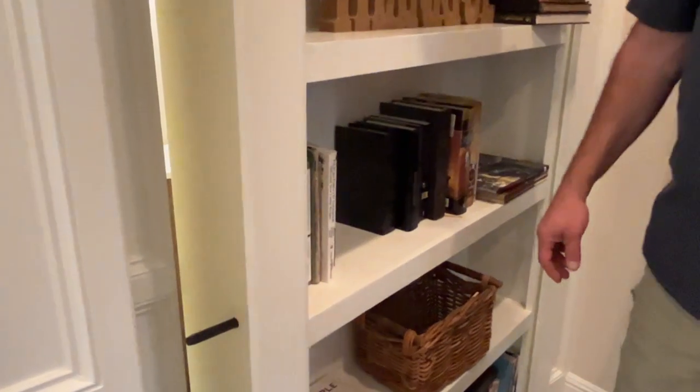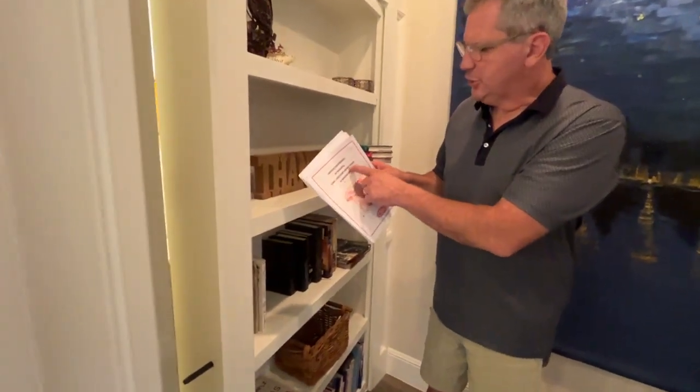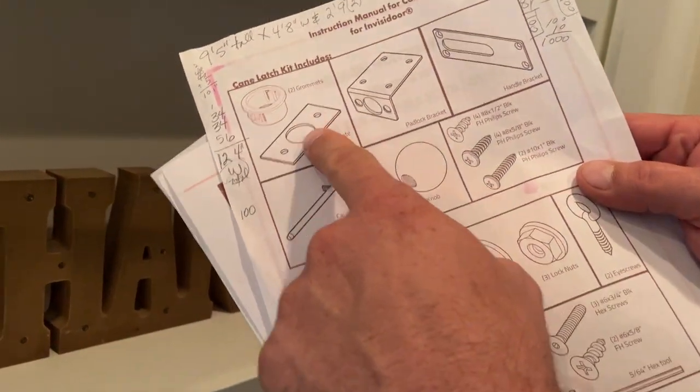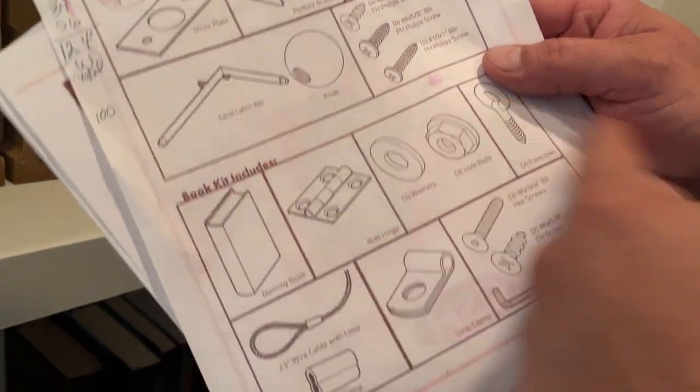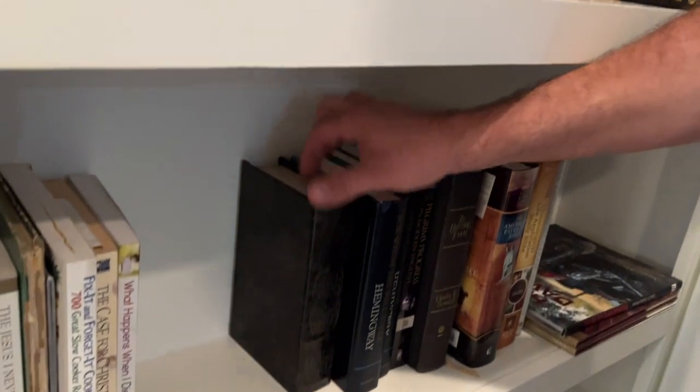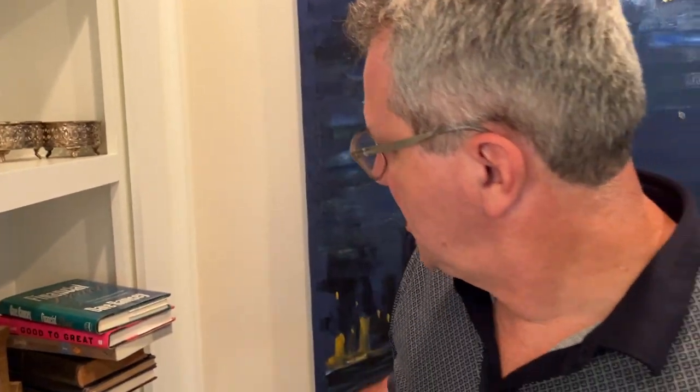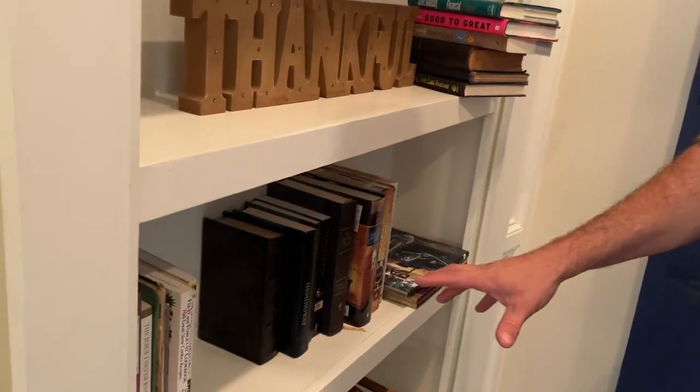The next step is to disguise it. I do recommend the kit — Crane Latch and Secret Door — you can Google it and I'll put the link in the description. You could try to make this yourself, but the things you probably couldn't make are the bar and the sized components — so it's probably worth the money. The book is all wood and opens so you can get inside to bolt it, and it's your handle, so you need something pretty sturdy. We talked about taking a paper cover off one of the other books and wrapping it around this one so it doesn't look like the secret book and blends in with the rest. We may still do that.